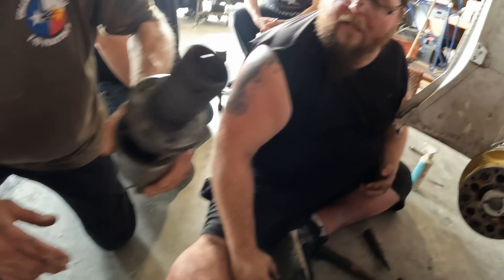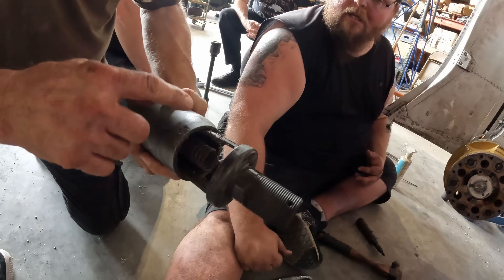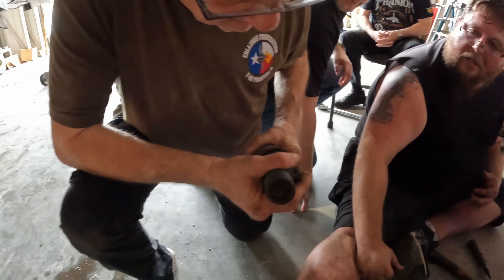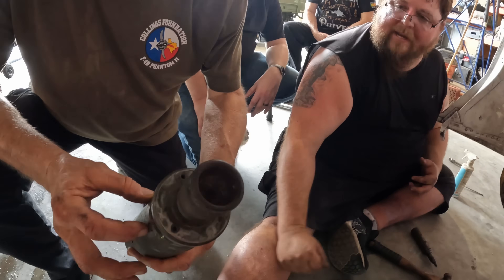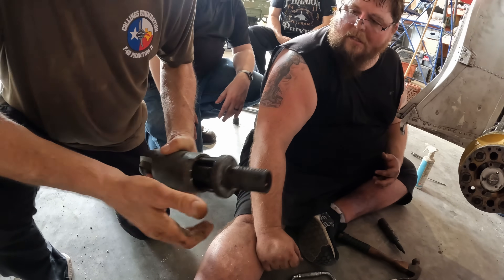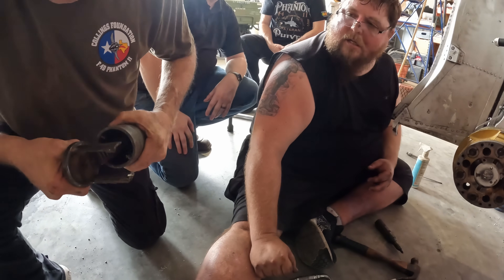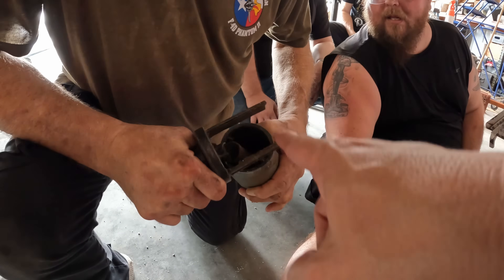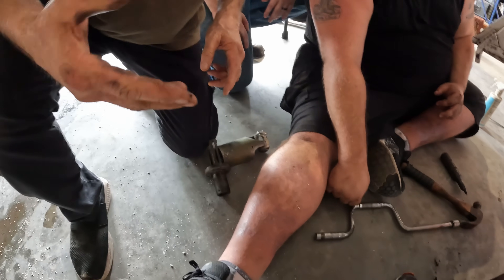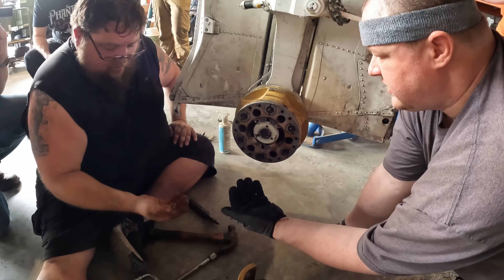All right, where's the pin? There's still something — remember, it shouldn't come out far enough to do that damage. It came out far enough and there was a wedge. But there's a pin that only allows it to come out so far — you can't physically pull it out. These pins don't go all the way through. They're sheared — see, the pins are supposed to ride in their slots, but they're sheared and not in there anymore. Look at that — it popped out of the slots. So we might be able to get that repaired.